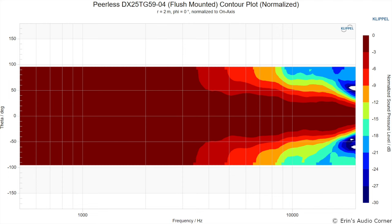The sound radiating off-axis is stronger than the on-axis sound arriving at your ear first, and you cannot simply equalize that. If you try to drop it down with EQ, your RTA may show it's flat, but the timbre mismatch problem still exists. Compare that to the flush-mounted design — the response is much more linear. This is the exact same $25 tweeter shown in two different mounting methods, and the flush-mounted version is far more equalizable than the surface-mounted version.